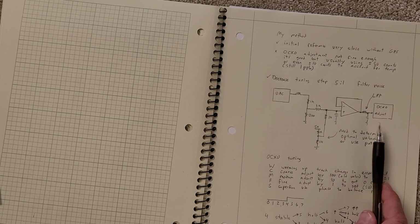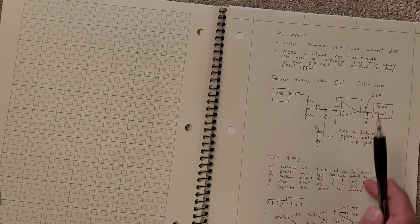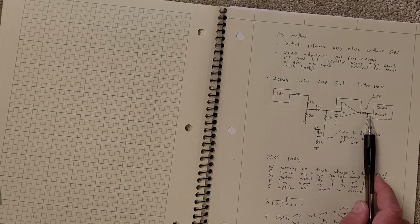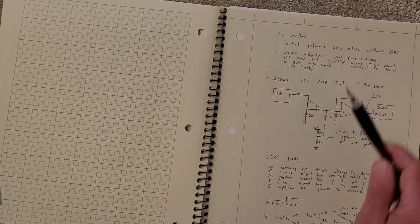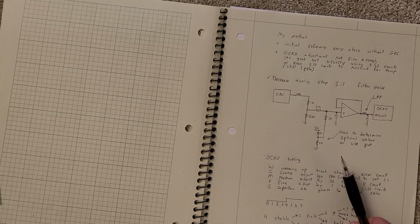I can still see a difference on a DAC count of 1 millivolt. I expect that I'll see a difference in the DAC count when I reduce it. And 10 to 1 might be too extreme, but that's probably okay. I'd rather have it be that I tune it and I don't really see anything till I go up or down a couple counts. That's better than throwing away fine-tuning ability.